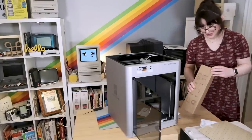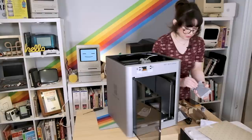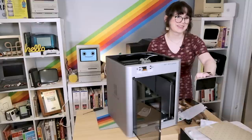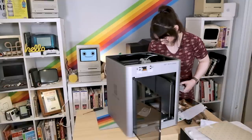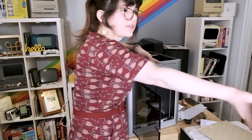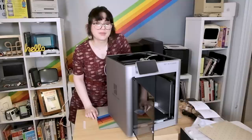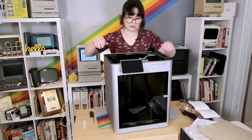Let's go ahead and open this up. Here's the little Bambu screen. Let's take off the tape. One thing I like about these more modern 3D printers is that they have nice creature comforts and accoutrements, such as this screen — a little screen that acts as your controller for all your stuff. The way you do it is put the wire in, push it in, slide it to the left. Screen is in. Now that we've got the screen on, it's time to get the AMS set up. All this work is going to be on the back of the machine, so let's turn it around.